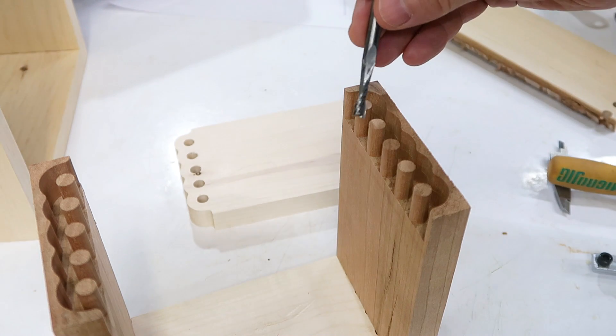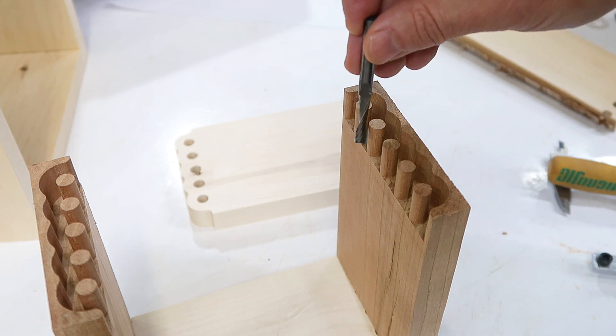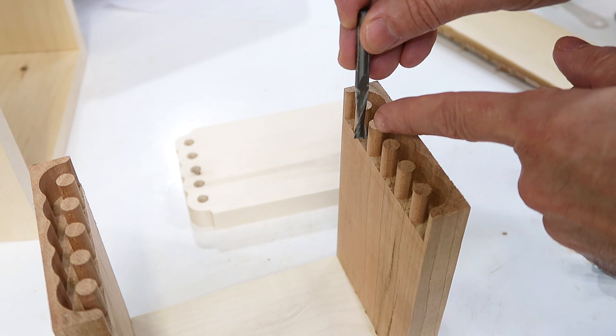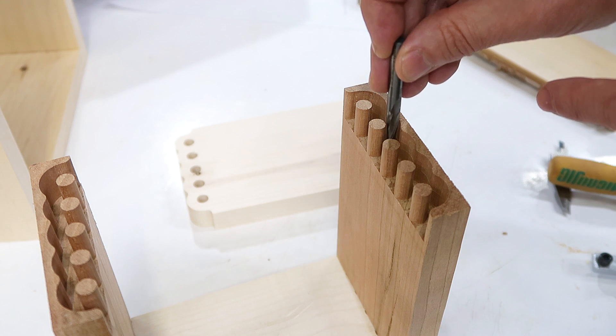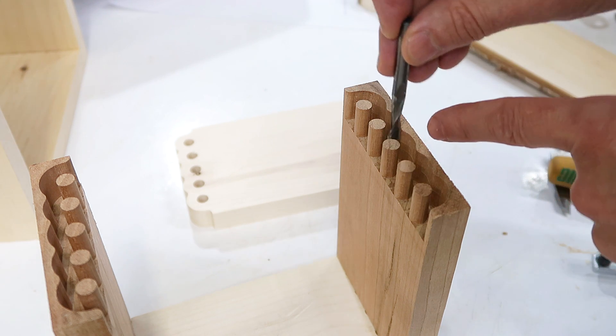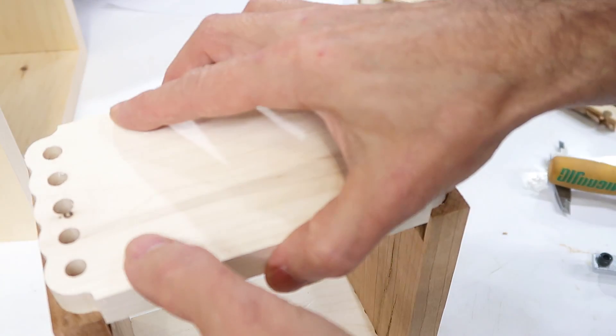I made a mistake when I cut some of these. When I swept around the dowel pins I swept in this direction, but the problem is that pulls the bit in towards the middle of the dowel — I should have swept in the other direction. I think I may have cut some of these in the wrong direction as well, which results in a little bit of gap in there.